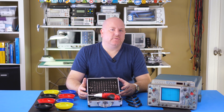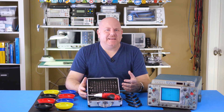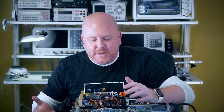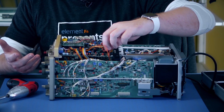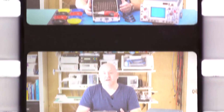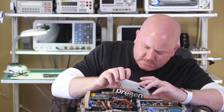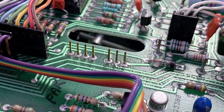I had a little bit of trouble removing the DMM board — it has a rather unique fit. I needed to disconnect some of the cables, and that's when I realized something interesting. There are little jumper wires that look like the jumpers you'd see on an Arduino project. This piece of test equipment has 0.1-inch or 2.54-millimeter headers for wires all over the place. I'm really glad I took pictures, because when I tried to put the DMM back into place, I realized there was no silkscreen for any of the header cables.